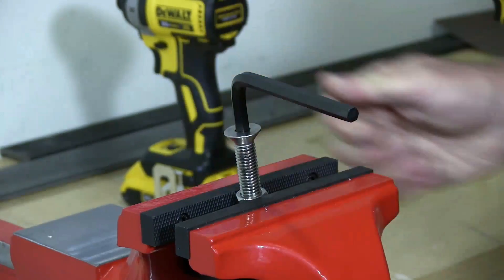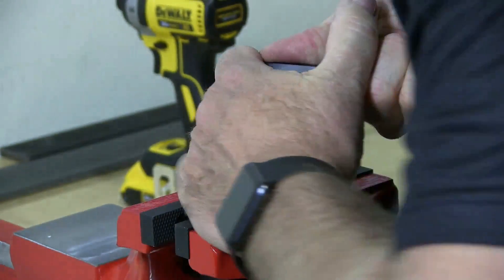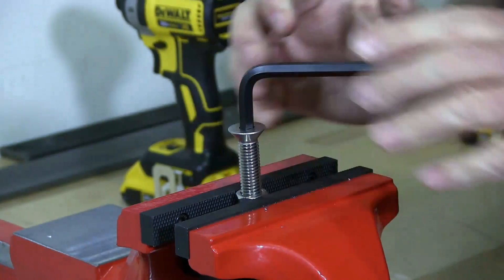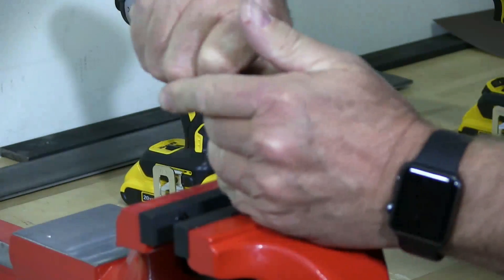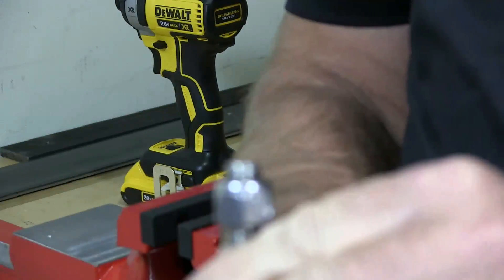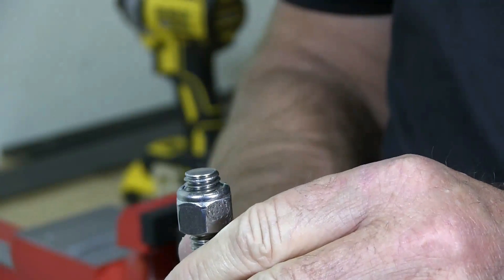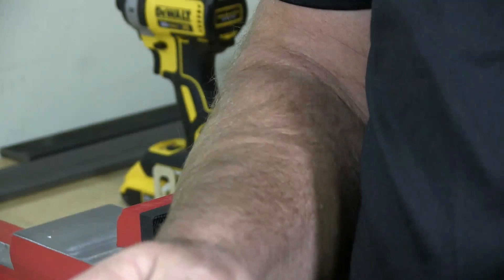And that's it — no more. I can back it off but it's just going to keep jamming further. Now it's jamming in the opposite direction. This is exactly what they call galling — seizing of the two threads mating together. It goes to show you how far I got down, not that far. This is a continual problem with stainless steel. If you use an impact wrench or a drill and try to drive it on, the bolt is just going to snap off. I can feel the heat in the nut from the friction.